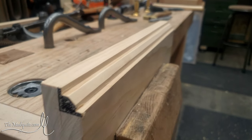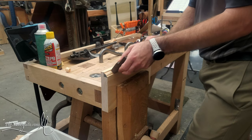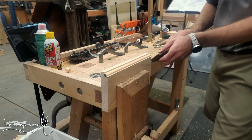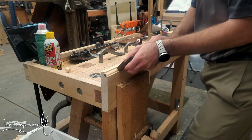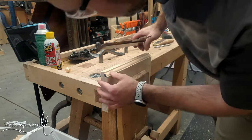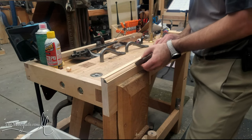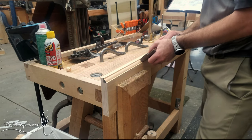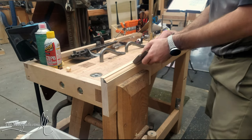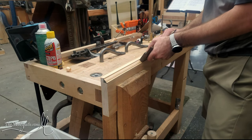Next I come in with the actual round plane, starting at about a 45-degree angle to hit both corners from where I knocked that corner off with the block plane. So now there are two corners, and you start getting two little narrow shavings. Sooner or later you'll start taking full-width single shavings, and that's basically where I'm at here. Then you start rocking the plane down a little bit and then up a little bit until it all works out.